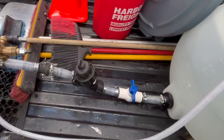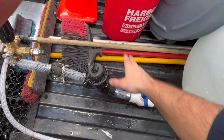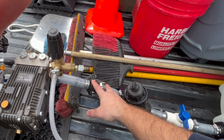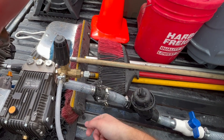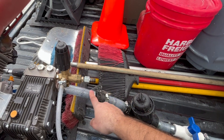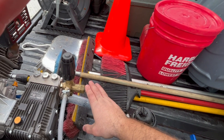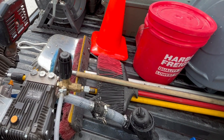The setup is plumbed with a bulkhead to the ball valve — it's nice to be able to turn that on and off. There's a filter and a quick connect here so I can take it on and off. When I first started the machine, I needed to prime it with some water, so I unhooked that and put a hose right there to get water in — gravity wasn't pulling it up. But I haven't had to prime it since, even when I empty it. Right now it's cold at night, so I make sure to empty the pump of all water and put a shop light on it to keep it warm and prevent freezing. Getting all the fittings to not leak was a real challenge — good plumbers tape and a paste you put on the threads helped. It's not a permanent sealer, it's temporary.